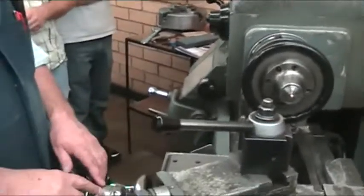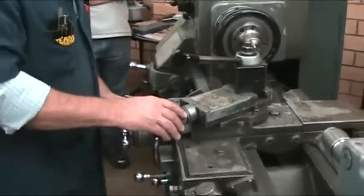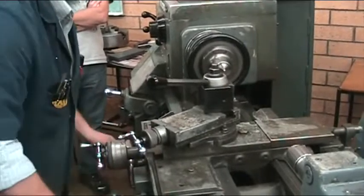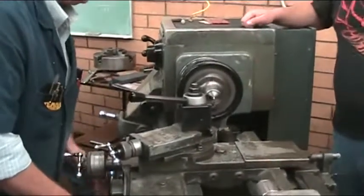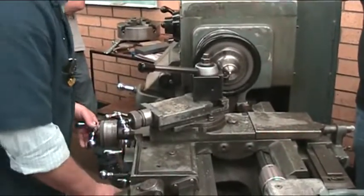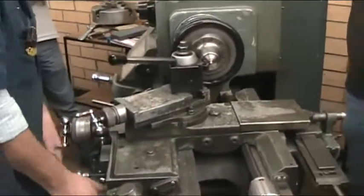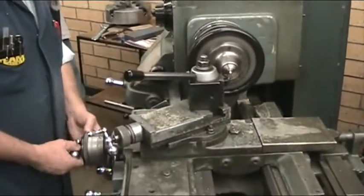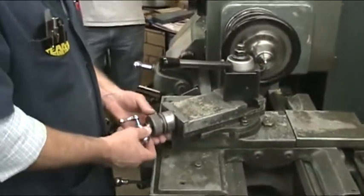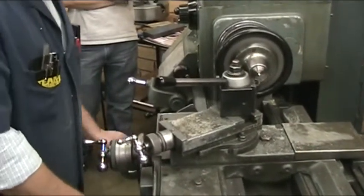All right, so which one am I going to turn? This one's at zero, this one's where it was when we cut it last. Okay, I'm going to go 2 thousandths instead of just one on this one, or instead of five, because we're still quite a bit bigger. So that should get us to about 267, right? Let's do about 265.